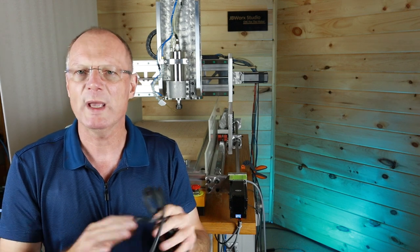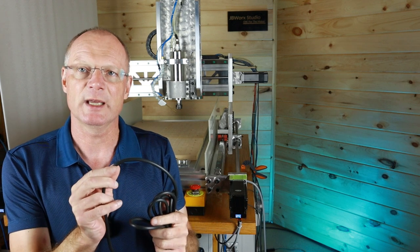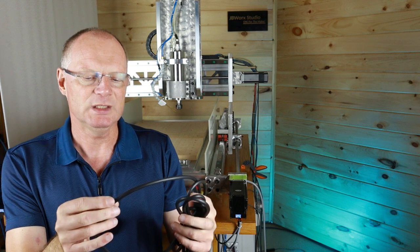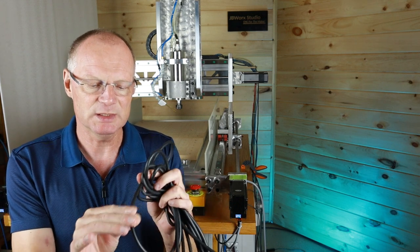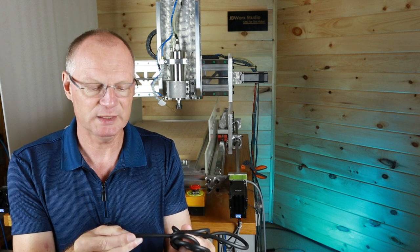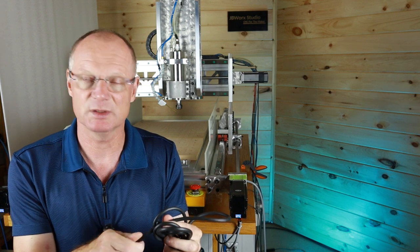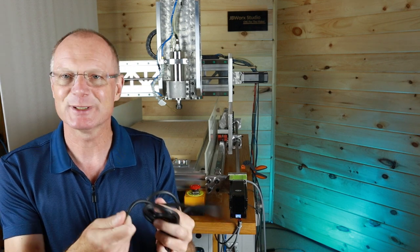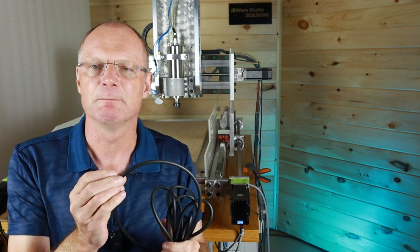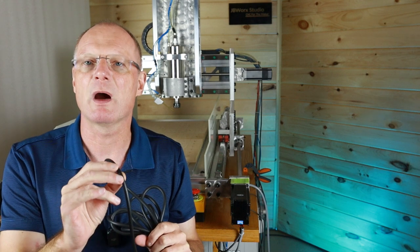You have way more margin for error if you're using a foam type seal, almost like a weather strip. The next is that this seal does need to have a smooth layer on the outside, not foam. Otherwise, it's not sealed, and we want it to seal. Next is the groove itself, where the seal is going to fit in. Make it so that the seal doesn't stick too far out.